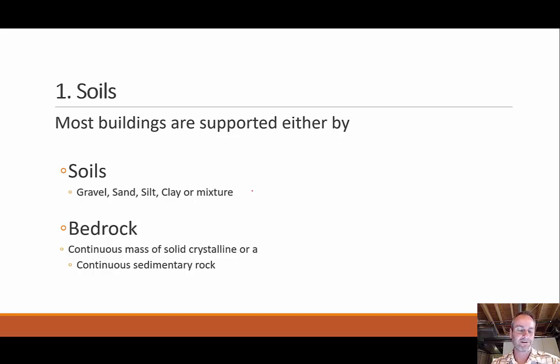Soils is a cool topic. The CM majors will have a whole class in soils, and there's even a soils lab where you do experiments like rubbing it between your hands, pounding it and seeing how much water comes out, or baking it. When we put a building on a site, it's going to either be supported by the soil directly or you're going to drill all the way through to bedrock. But 90% of the time, especially in Colorado, we're going to be building on top of soils. Soils are more movable — your sand, gravels, silts — versus bedrock, which is a solid base structure that is not going to move or settle over time.